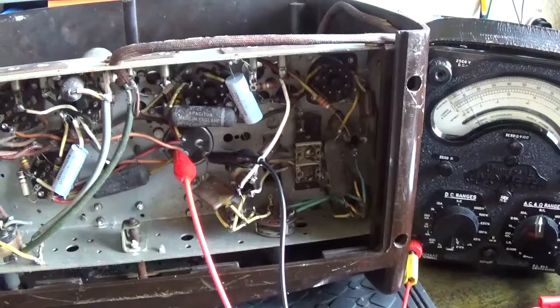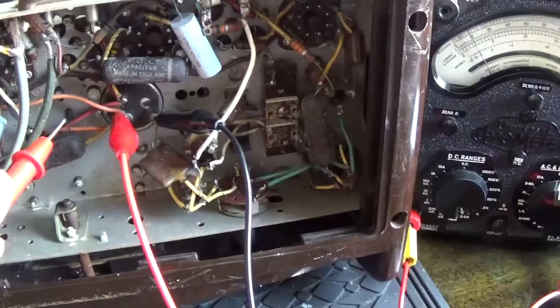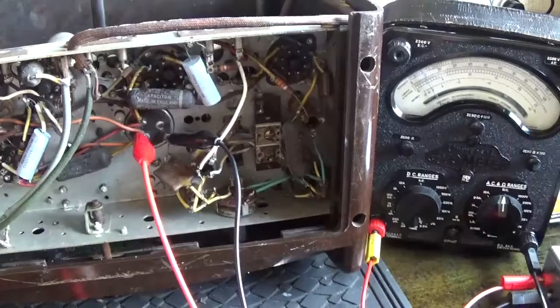The other side reformed quite nicely as well - it's not perfect by any means, but it is 60 to 70 years old. I'm quite happy with that. Perhaps it's a new can actually - I can see someone's possibly re-soldered these wires, they don't look as dull as some of the other wiring which I guess is original. So maybe someone's put a new can in there. I haven't had the chassis out yet to check the date on the can.